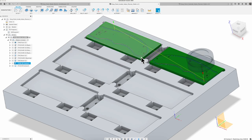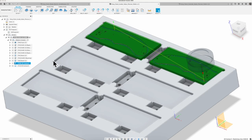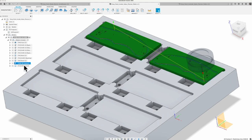And then we're going to cut around the profile so that when I set it down from the other side, we'll be able to finish that and it will already be beveled. That's really the main thing, is I didn't want to have to set this up again to bevel or chamfer it. So we cut around the profile and then I cut the chamfer on there and then we're done. So then this side is finished for those two.